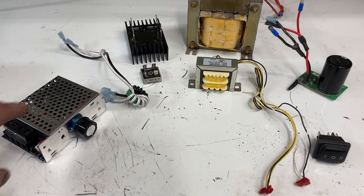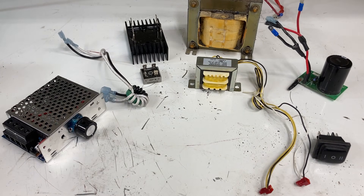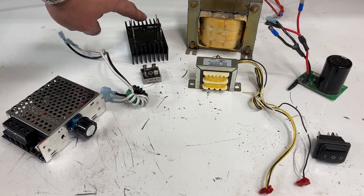After coming out of the SCR voltage controller, I go into a ferrite choke. This is an optional piece — every treadmill I've taken apart, and that's seven now, has had one of these in it. What this does is help eliminate some of the power spikes, because as I said the SCR voltage controller creates dirty power and a ferrite choke will help eliminate some of that. I run mine between the SCR voltage controller and the bridge rectifier.